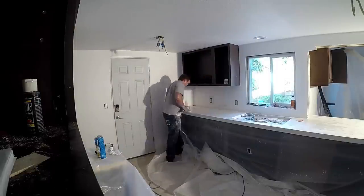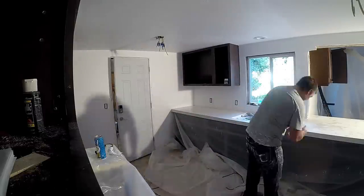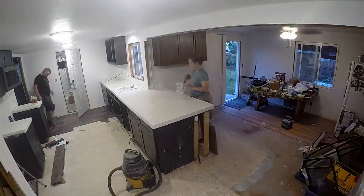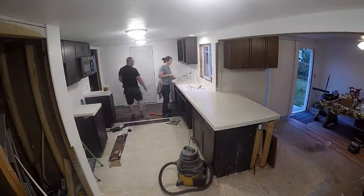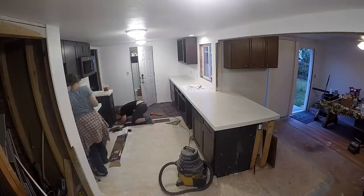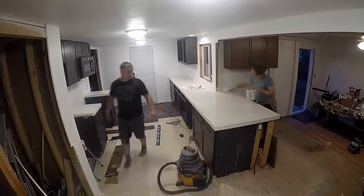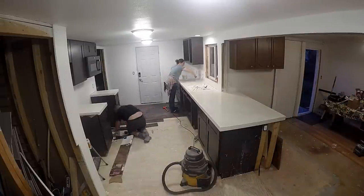One thing I want to recommend: don't be stupid like me — wear your safety gear. That includes a plastic apron because concrete has lye in it and does not react well to your skin, and I found that out the hard way. Next we move on to sealers. We used the Z Countertop water-based sealer — they recommend three to four coats, but we did five or six since it's white and we want it completely protected. That's one application per hour with drying time in between. Use a tight-celled roller so you don't leave foam fuzzies, then repeat the same process with the wax polish.